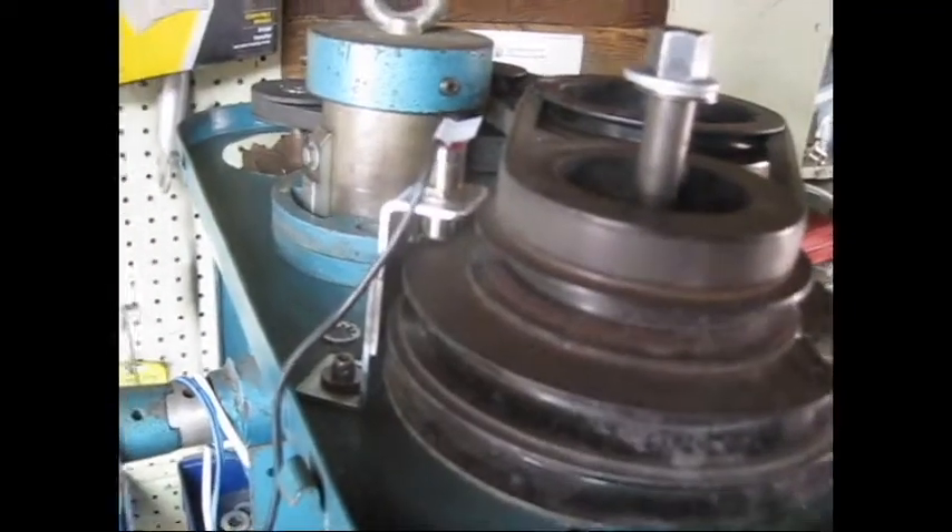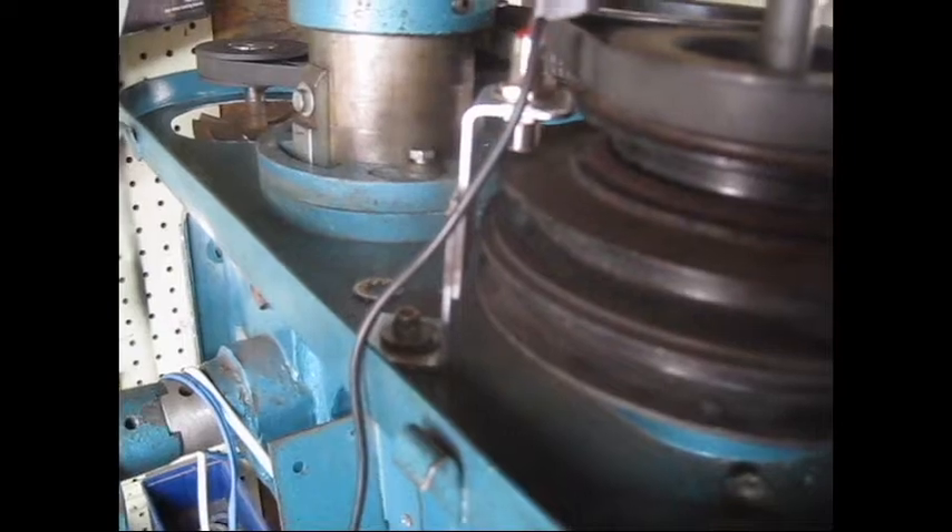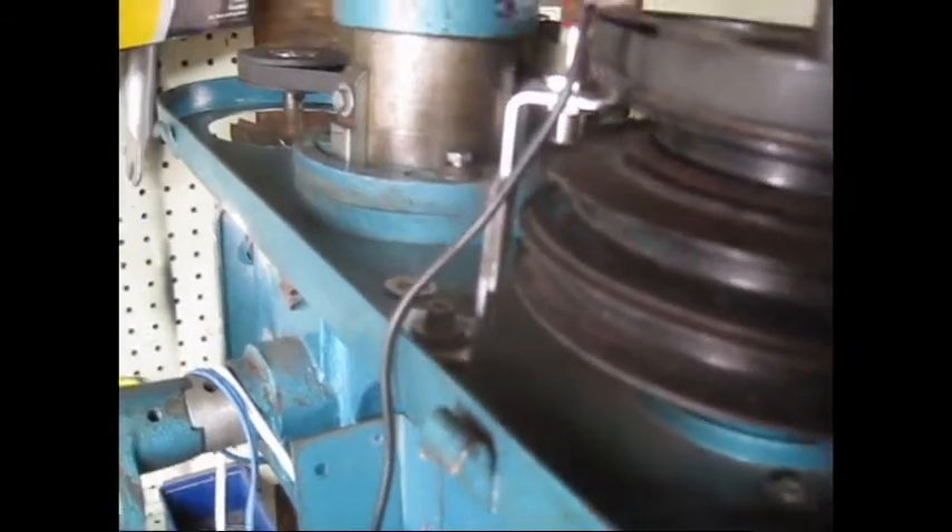This is the hall effect sensor mounted above the main pulley. I had a couple of brackets that I just welded together — they're very sturdy and they've got pretty big holes top and bottom, so it makes adjustment a little bit easier. I don't think it's that critical once you have the magnet facing the right way.